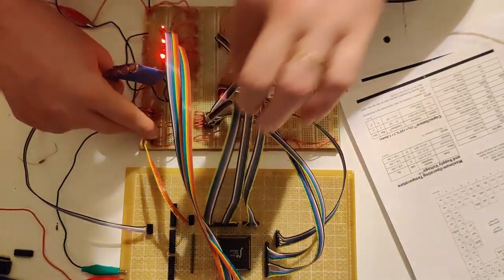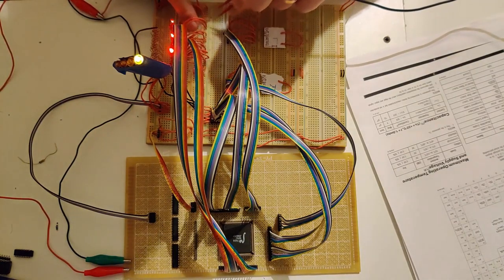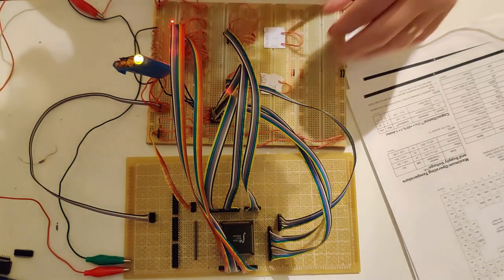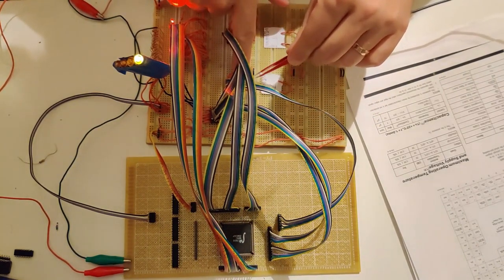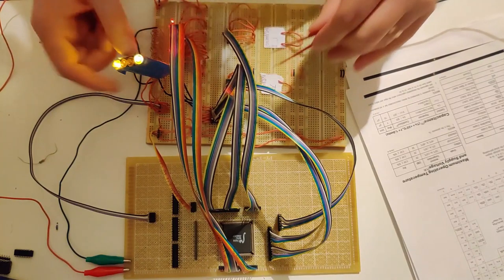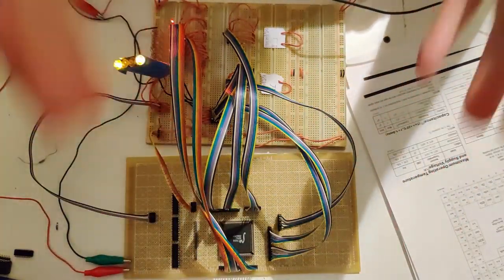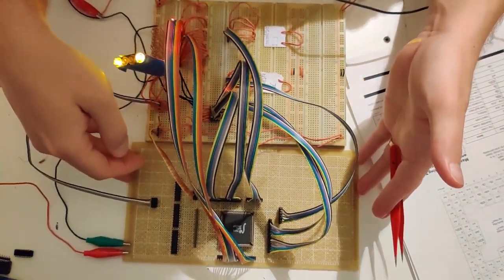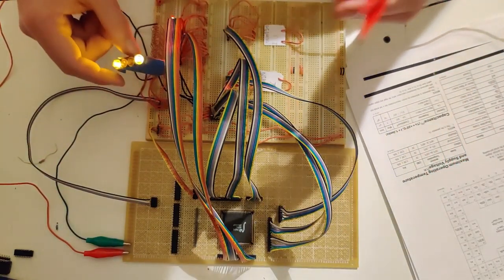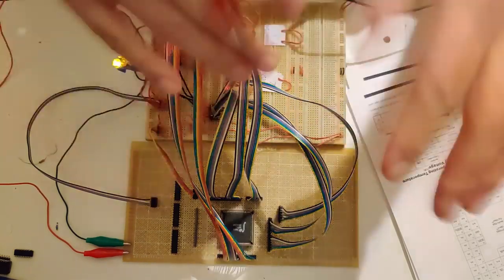So that's a really good next step. And if I change these values up, let's just, I'll turn the high one on as well. There we go, turned on that high pixel. And let's do another write. There, did you see that? That changed right away. So that's how we can write on one side and immediately, even if they were at the same address, the video hardware and the CPU, completely asynchronously, if this was reading that pixel, it would change at the time that it's written, so that there's no contention.